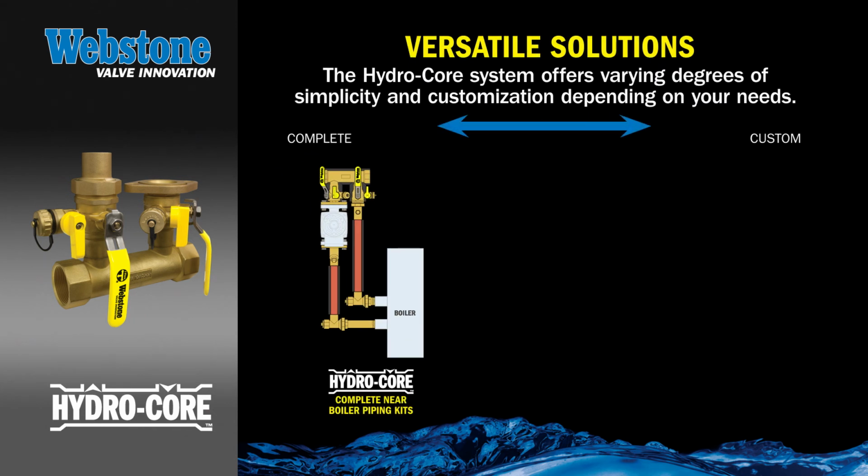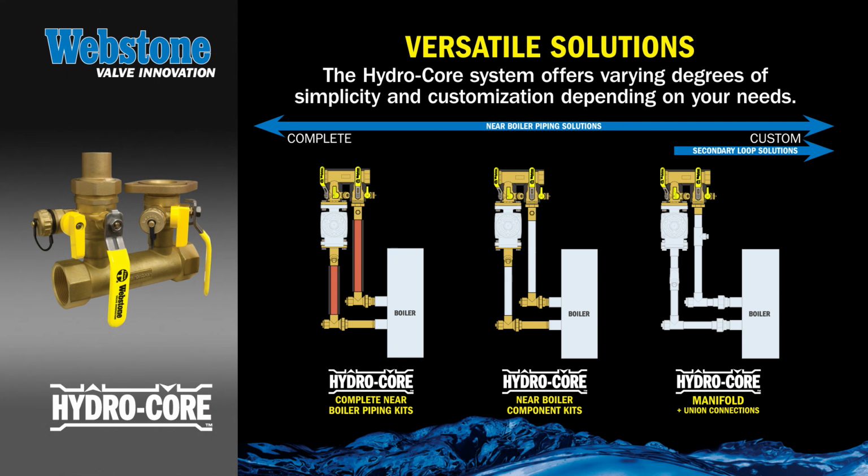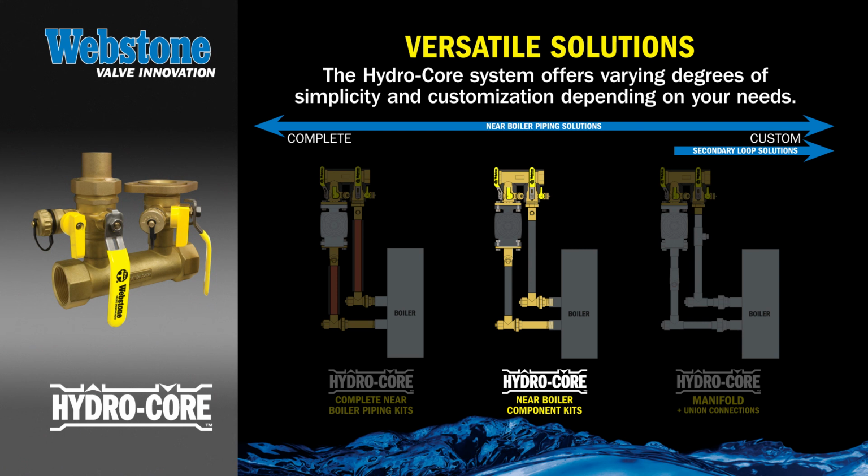While complete near boiler piping kits have been carefully developed to accommodate the most common installations, we recognize that every installation is a little different. And in rare cases, our prefabricated piping may not be your preferred solution. In that event, you can still benefit from Hydrocore's other advantages by selecting our near boiler component kits. Component kits include the manifold, pump, and boiler connections, but leave the installer to fabricate the desired piping configuration in the field.